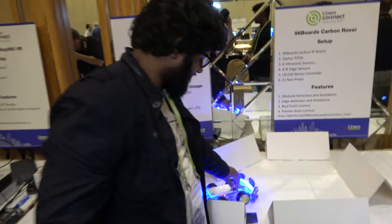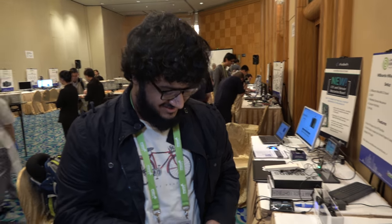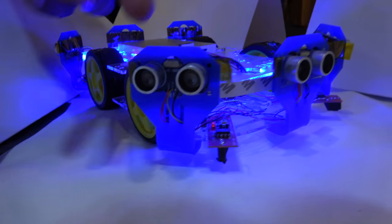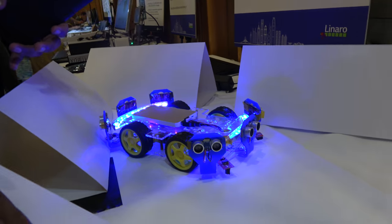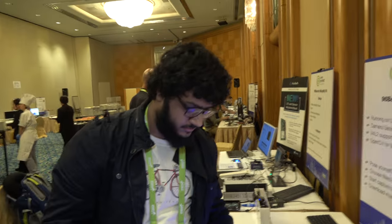Whenever you want — it's open source. So what kind of sensors are these? These are ultrasonic sensors, that's why they didn't work well with the cloth. It kind of works with paper, but if it's like a wood or metallic object, then it works just fine.